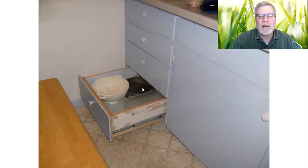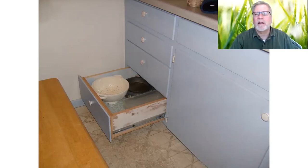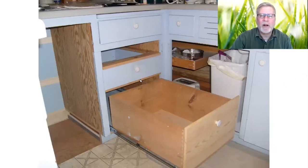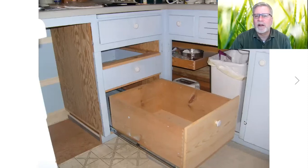This does look like what usually got stored in here was things for baking. Here's that drawer I had measured up earlier with the pan on its edge. I've got full extension ball bearing drawer guides on here, so it comes all the way out — the back is completely out in front of the cabinets. This is a super long set of dovetail joints, so you could slam that thing all day every day and it's not going to come off.